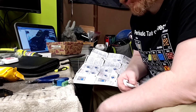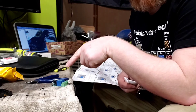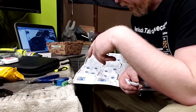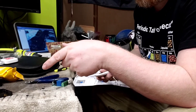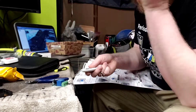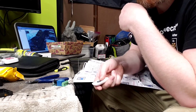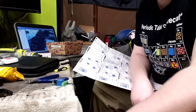According to these Chinese instructions, you gotta press and hold this little button until the red light goes green, then back to red — or vice versa — and that apparently clears out the code. So in order to program the thing, you have to clear out the remotes, which sounds kind of stupid. Then you hold the button down until it blinks once for momentary, twice for toggle, etc. Then you hit the button again, hit the remote, and hold the button until it blinks back and forth again. If you're lucky, when you let go it'll blink twice telling you it accepted the remote — which didn't work the first two times. Now I have one remote working as momentary. The other remote is lighting up on the board when I push it, but it ain't doing anything.